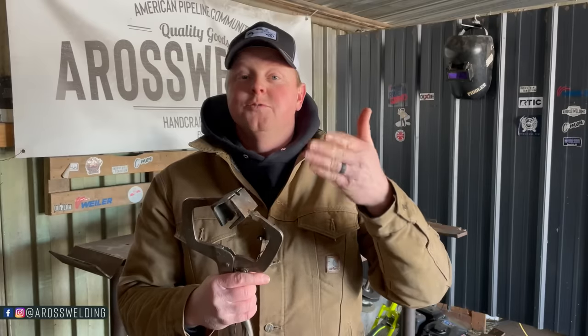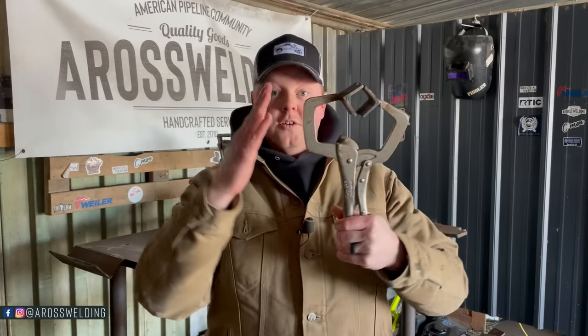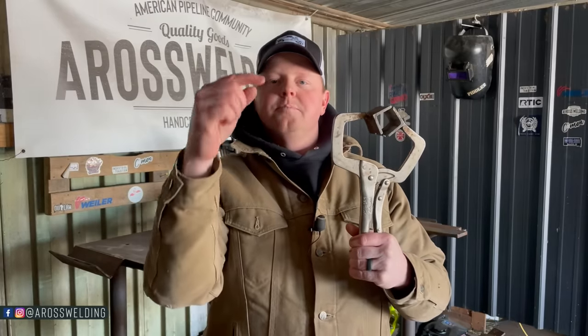In the past, I've used my gate jacks to hang cattle panel, and because I didn't do that this time, where my cattle panels met, they ended up being a little bit further apart than what I liked, so I had to use this to squeeze them together. So if you're using gate jacks, then I would recommend making sure that your vertical pieces are parallel and almost touching. But like I said, to do that, you'll have to trim off the little overlap pieces on your cattle panel.